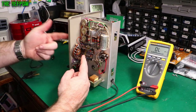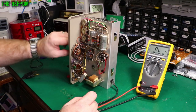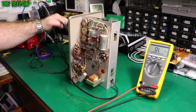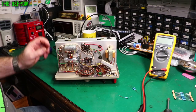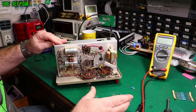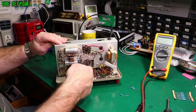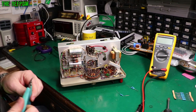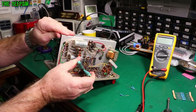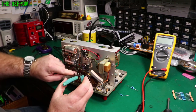So we've got two over here which I'm suspicious about, the rest I've seen are fine. Now the ones in here - where you set the voltage, the signal has to go through those resistors in a chain, so everything goes through those first two. If it's been stressed anywhere, those first ones would go - which is possibly what's happened. I'm getting weird readings on that one. Let's get these resistors out of here - I've got to cut these things out. After much messing around I found some resistors I can use - I didn't have a 22k 1-watt resistor, so I've got a 20k and a 2k which will have to do, plus a 10k to replace the other suspicious one.